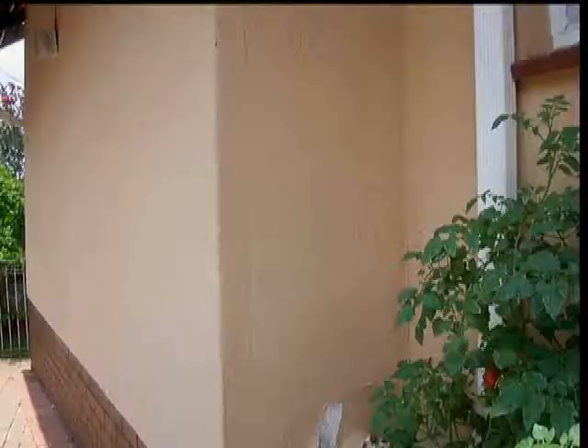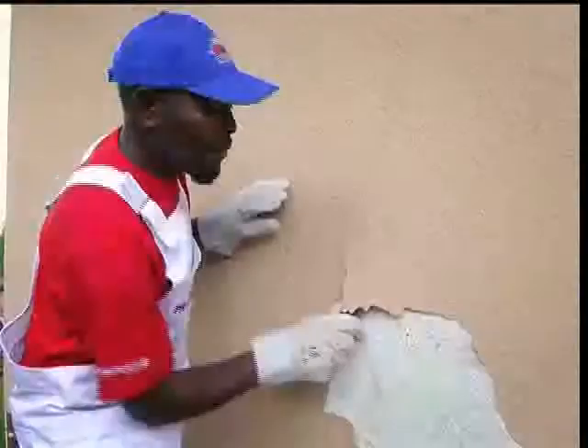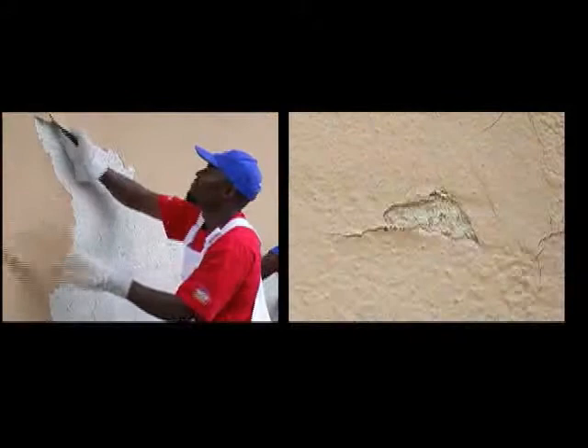This looks to me like a brand new coat of paint, and basically what it's doing is adhering to the previous coat that is no longer sticking to the primer — the original primer placed on the wall. I think it's mainly due to the fact that the primer has reached the end of its lifespan. So what we're going to have to do is strip this wall completely, start afresh brand new. We'll look at issues of waterproofing and we'll open up the cracks where need be, and we will repair this wall.